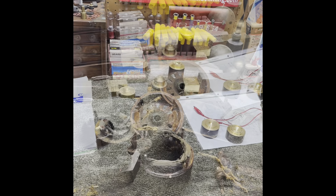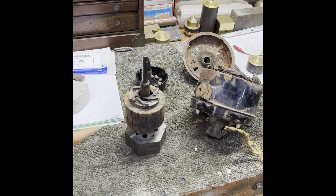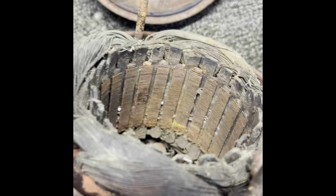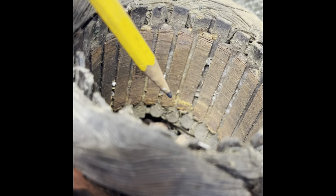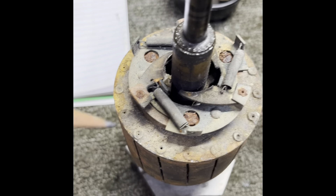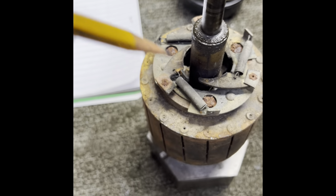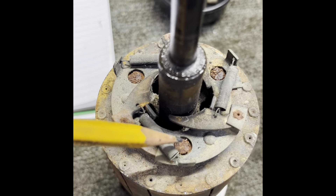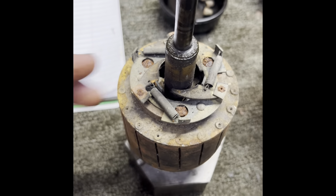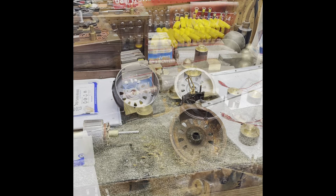Just a quick update — we've got the tank motor open and you can see how badly rusted it is inside. A lot of cleaning to do, and we're definitely going to have to replace bearings. Down in here, see all that goop — the rotor's in really bad shape. The centrifugal switch isn't opening and closing like it ought to. These screws are rusted so bad I don't think I can even get a screwdriver in there — a lot of times they'll break off and you have to drill them out and rethread. It's going to require a lot of time cleaning this thing up.